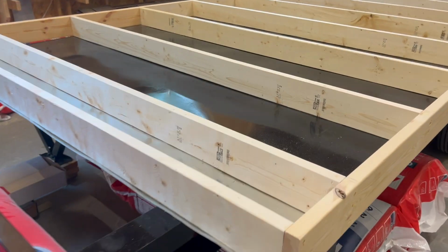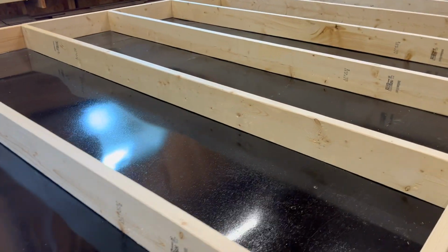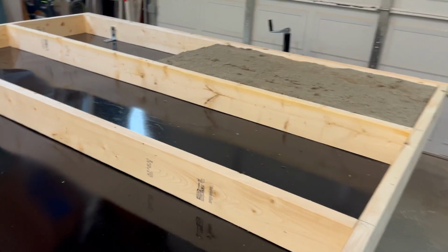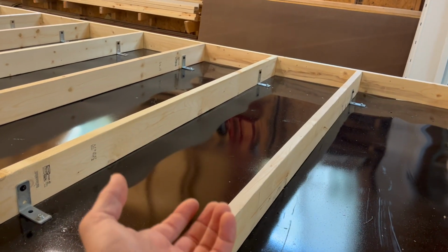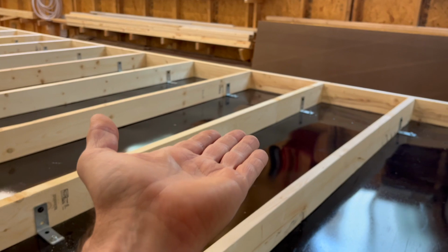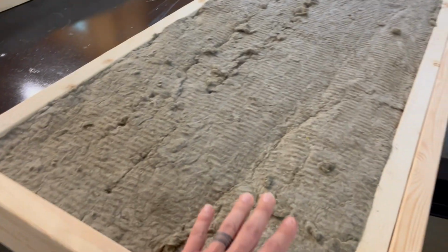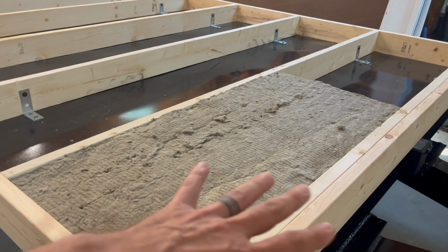Now, that does mean that we have to build a floor structure on top of the trailer, on top of the chassis, which actually has some benefits. If we walk down to this end, instead of having the insulation tucked in between steel tubes that very easily bridge, or bring that cold, or potentially hot, thermal energy right up to the floor and can create an uncomfortable floor, in this case, we have a wood structure. The wood is much more insulative than tube steel, and then we fill our cavities with rock wool, which is a great choice. Easy to get a hold of these days.